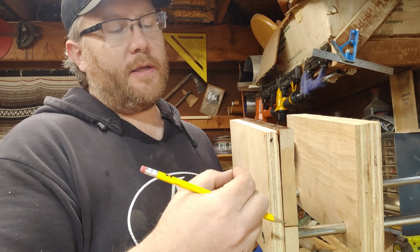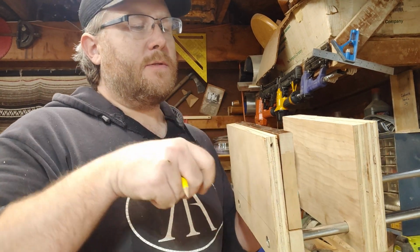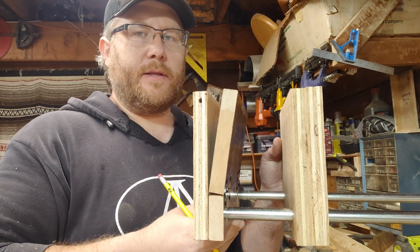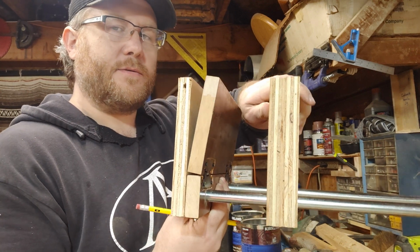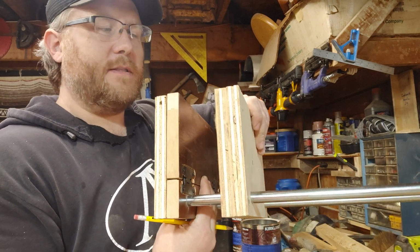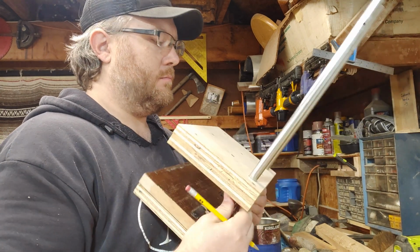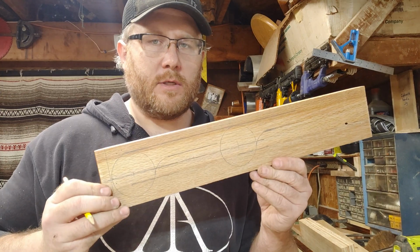and I want to hinge it out approximately 1/2 inch off of this board, so that way when I press down, it'll clamp it in like that, and that'll press this against those bars, give me a good friction fit. And when you release the cams, this will come back, relieving the tension, and you can slide this theoretically in and out. I'm gonna go cut these out quick.